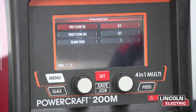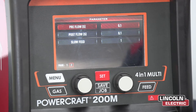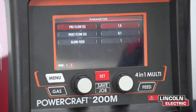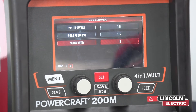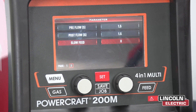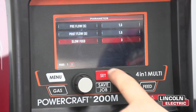Go on to the next page. You want to set your pre-flow — pre-flow is the flow of gas coming out of the tip before the welding. Set that to about 1.5. Now you've got post-flow, which protects the weld after you've finished welding for a certain amount of time — set that to about the same. Now go down to slow feed. Slow feed is how fast the wire comes out of the tip before you initiate the arc — set that on around about 3. Once done, press set again.